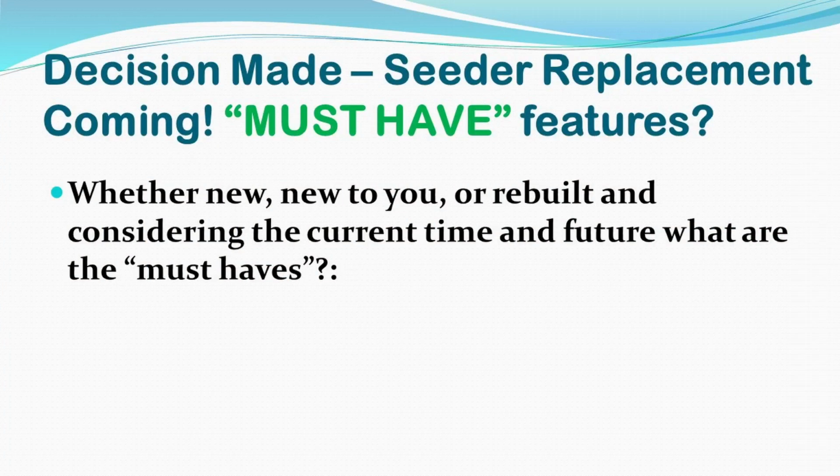When you think of your planter and your drill, there are must-have things that you need on a planter, and there are nice-to-have things. What do you consider the must-have things? You must have adequate ballast, particularly in no-till, and you must have enough downforce, whether it be mechanical or hydraulic. A big advantage to make the no-till system work is to have the soil dry.